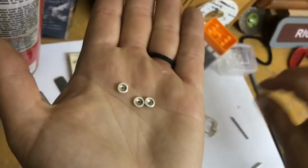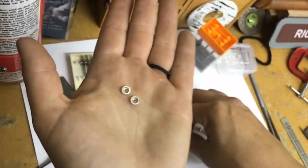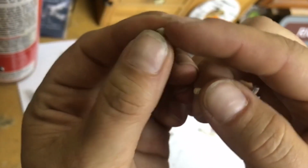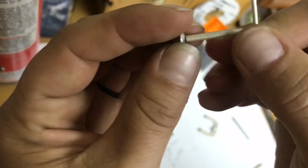Obviously, they're longer than they need to be right now because of best practices. I can make them shorter, but I don't know how short exactly yet. So that will come. And then the pads of the little ends are these. So this is going to be drilled out bigger to be the tap hole size, and then I'll thread that, and then I'll be able to thread in this part. And so I got those little end nubs, jaw pads, sort of.